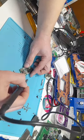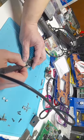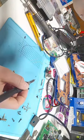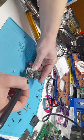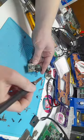So again, I'm just taking off those legs. They're stuck on the board. Is that a Game Gear? Yeah, it is. You have to get another kit though? Well, you've stumbled into the perfect live because I'm showing how I do my capacitor kits, or how I put capacitors on. Full detailed explanation because I'm making this into a YouTube video eventually. Now, when you're working around the power board, or pardon me, the audio board, just be careful because there's a lot of plastic on here that you might accidentally bump with your iron, and that's going to melt it.